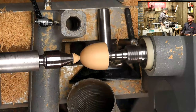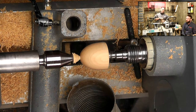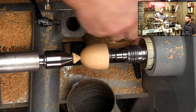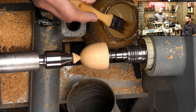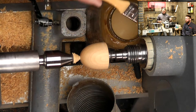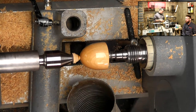So, one other thing to add when it comes to sharpening any tool, really, don't get caught up too much in what people say, just sharpen the chisel. There are just a few rules, I would say, and more angles more than anything else. But those angles are very varied. Certainly if we were talking skew, we can change the skew angle from anything between sort of 15 degrees right up to sort of 35, 40 degrees if you want to. So don't get too worried about it.